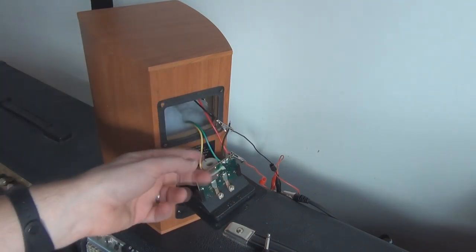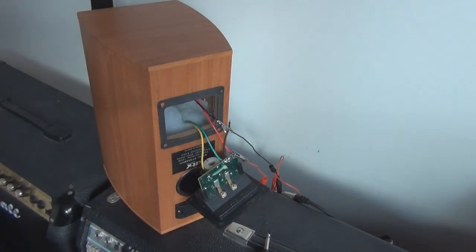So you're just trying to connect. I could have cut that as well, but I figured, save cutting another wire, I'll just connect it straight to the PCB there. So nothing overly complicated about that. You just want to bypass whatever circuitry you've got in the bookshelf speaker and any other little speakers that might be connected to it, particularly tweeters. They sound rubbish, and you don't want them outputting your guitar signal. So just go directly into the loudspeaker and it should be fine.